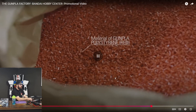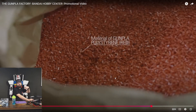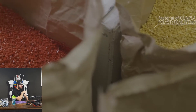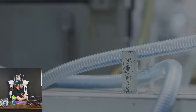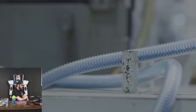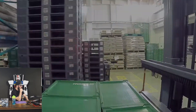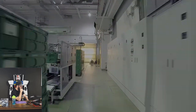There are all your different plastics — this is resin, this is what your plastic comes as when you buy it in bulk. For those in additive manufacturing, you're used to seeing it as filament, but most filament manufacturers don't make their own plastic — they buy bulk resin like this and run it through an extruder. There's a lot of polystyrene and ABS, and they do have something for the rubbery parts. You've got to dry the resin and then it usually feeds directly from the dryer right into the machines.